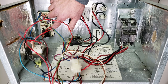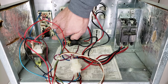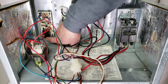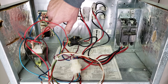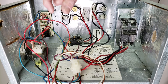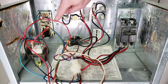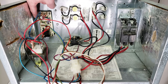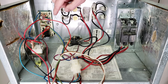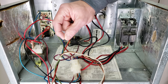There's a delay for when it's going to turn on the relay, and a delay for when it shuts off the relay. Inside this relay, there's a little relay that opens and closes contacts. Right here you have your common terminal, on the bottom you have your normally closed, and the top one is your normally open. Between normally open and common, those are normally open contacts. When you end up powering the relay inside this black box after your 7 seconds of applying 24 volts at G, those normally open contacts are going to close, and the contact between common and the normally closed is going to open up.